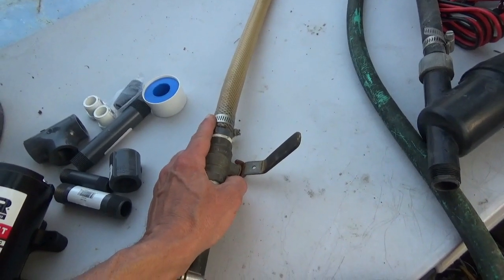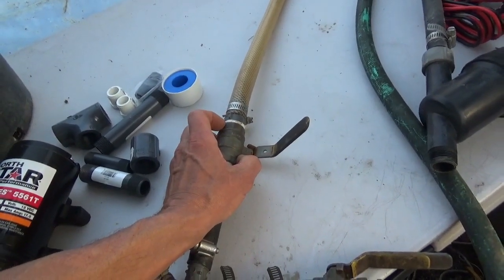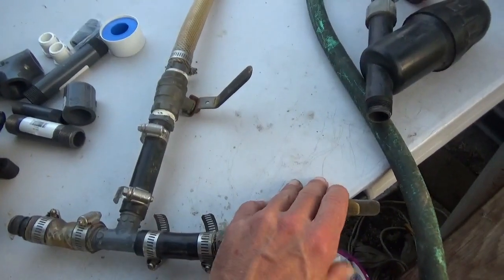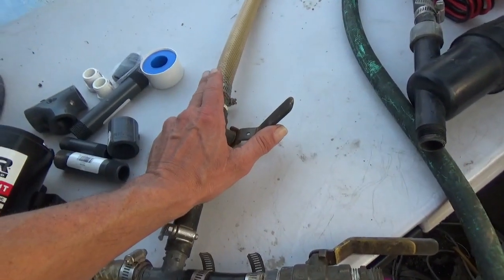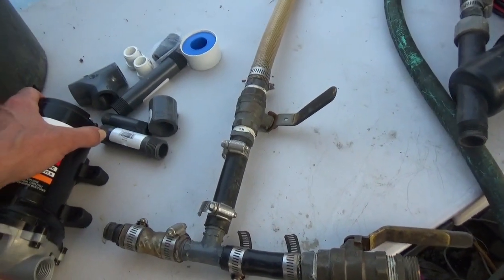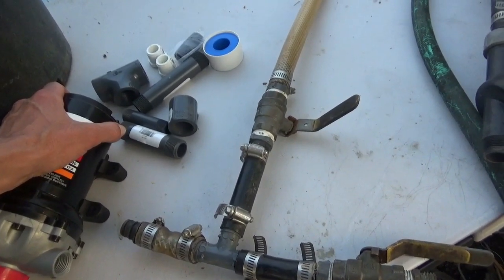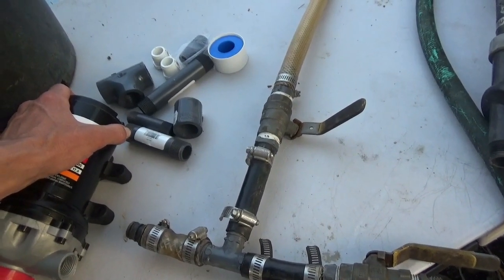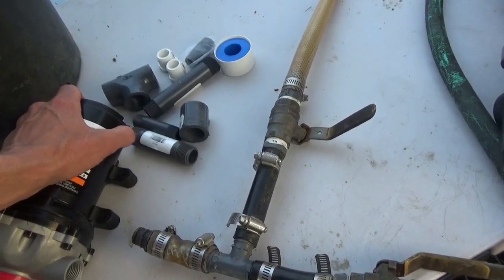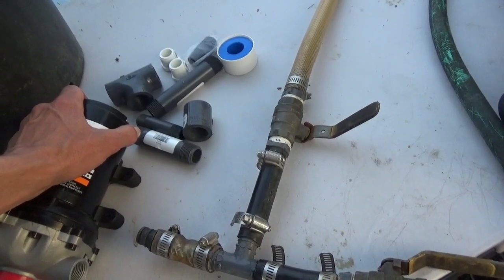I use a 15-gallon plastic barrel to mix my foliar feeds in, and so that's really handy when you're filling the barrel and when you start mixing the foliar feed up. So what I do is I shut the output off and I turn this recycle valve on, and so the pump spins the fluid in the tank over and basically mixes the foliar feed up for me to make sure that we have nice uniformity. You don't want to distribute foliar feeds unevenly. You want them even, and you want your concentration to stay even. So I use that on the initial mix-up, and also if I'm going between one crop and another, I'll flip it back to that and let it recirculate while I move from one location to another.